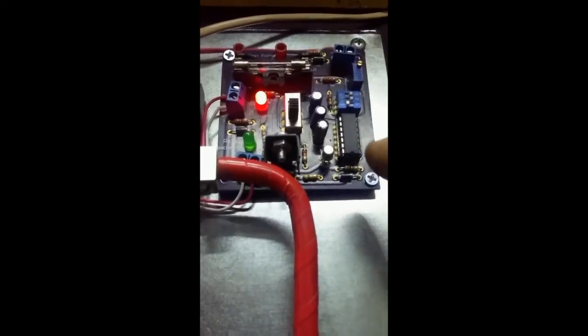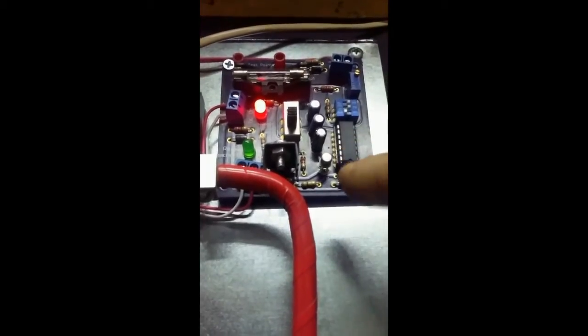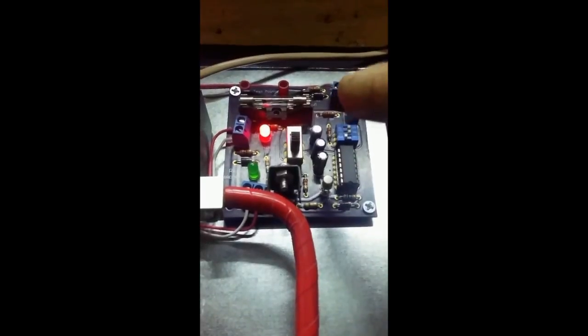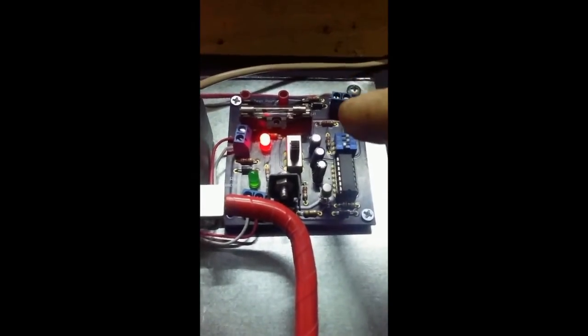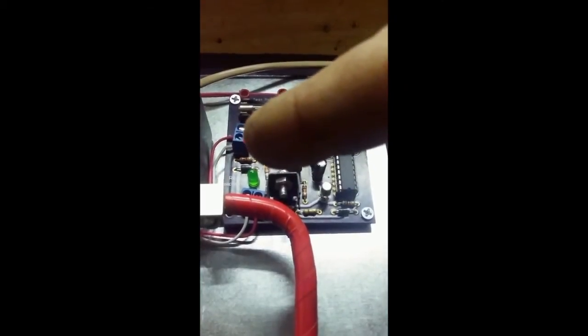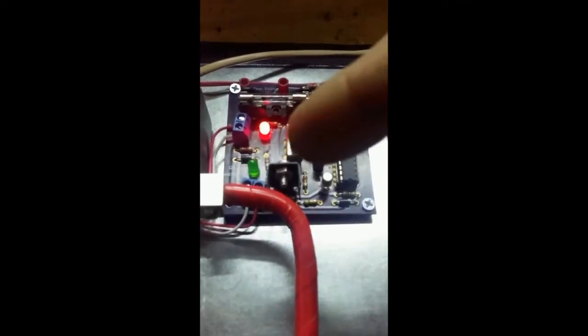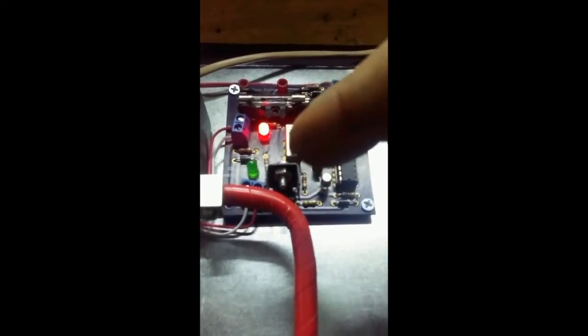This is our custom control board as you mentioned in the other videos. It takes from zero to 90 volt input. So your turbine DC positive and negative is tied up to these terminals here. It needs a 12 volt constant DC to work. And this is your external relay hookup. Over here you have a normally open or normally closed setting switch.